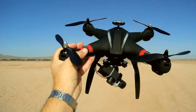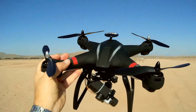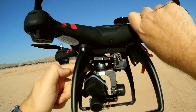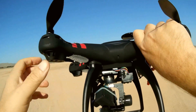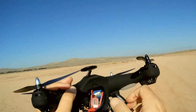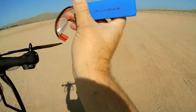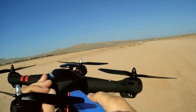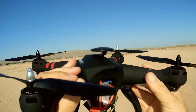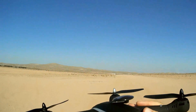We'll try it out and see if it actually works. I'll go over the controller shortly. As with the X-21, it is powered through this plug here — this 3-axis gimbal is controlled through that plug, and you can raise and lower the gimbal's view. The power comes from a pretty large battery — it's a 3S, 2200 milliampere-hour, 30C battery in the back. It's a fairly common battery, so you should be able to find replacements for it.